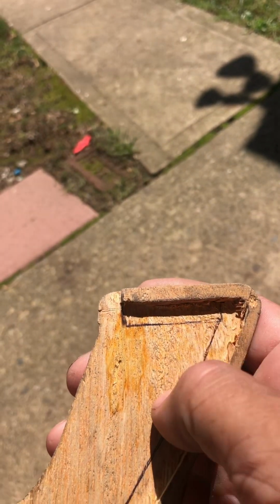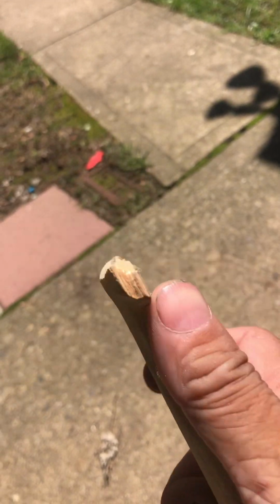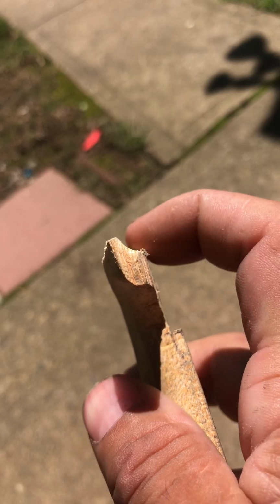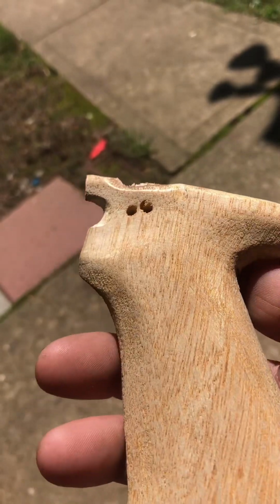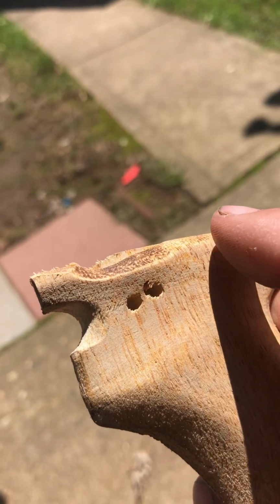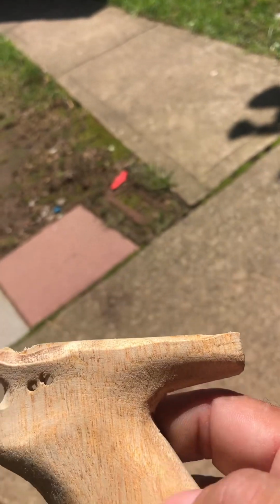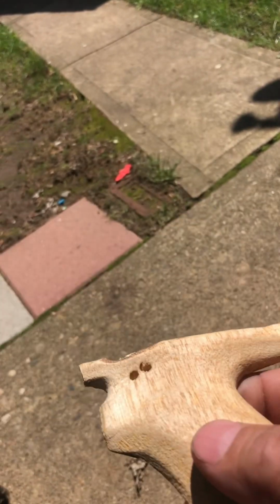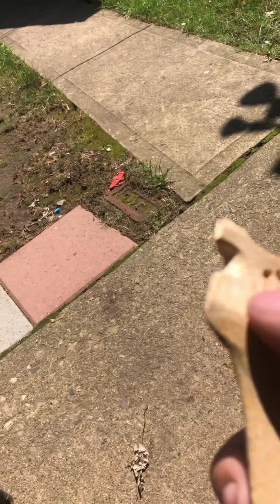So this one over here, I made about 3/8 wider, all the way around here. Also with a milling machine, I gave it the shape of the bottom barrel there, the pump barrel. Same thing here, I wanted to run the router here, but it didn't work because the bearing fell in this groove and it ate a chunk. So what I did is I ran it on the belt sander by hand. So I rounded this part by hand instead of using the router. So I learned that the hard way right here.